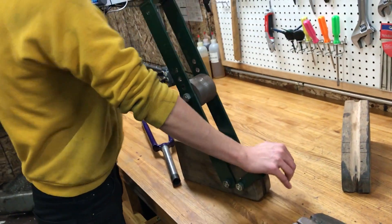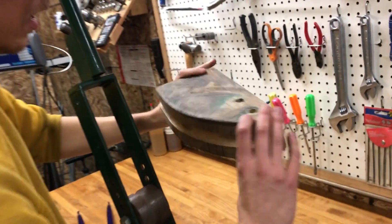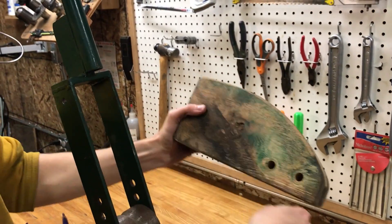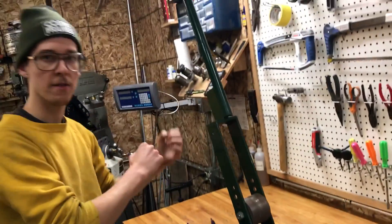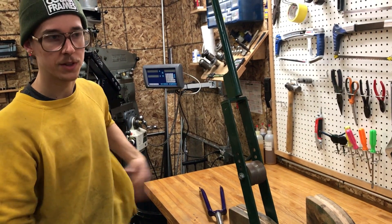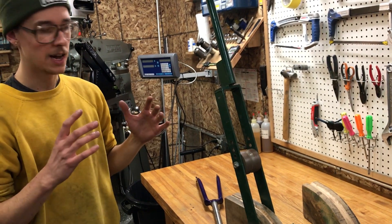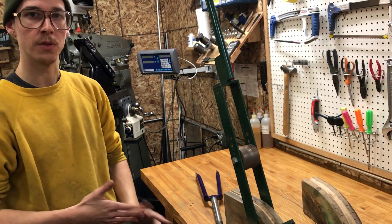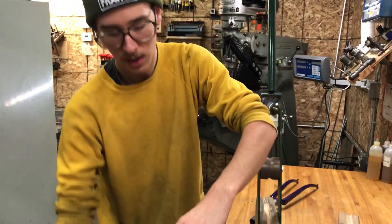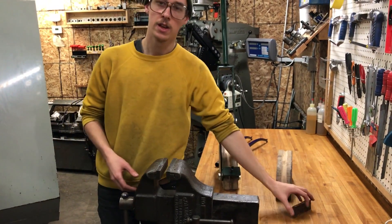Now you have a lever arm and you pull back. What I would do is use a pencil to put a mark on the bending arm where I thought I was going to bend to, bend that far, take it out, check the bend, and if it was good I'd put the other blade in and bend to the same mark. It's not the most precise or repeatable thing. The way I like to use this is in a bench vise, but you could easily build some sort of base for it and bolt it down — that might even be better.